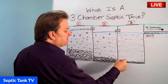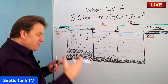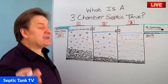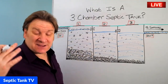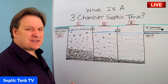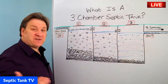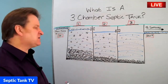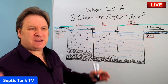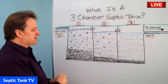And so the more suspended solids in your tank, the more it builds up, the more debris that can come loose and block your soakaway up. So it's quite important to get your septic tank desludged at least every 6 months, at least every 12 months. People don't bother because it costs like 200-300 quid a time to get it sucked out. But if you consider having to fork out 5, 6, 7 grand to replace your soakaway, paying out 200 quid just to maintain your septic tank and keep it healthy and extend the life of the soakaway is relatively a small price to pay in comparison to having to fork out all that money to replace your septic tank.